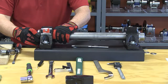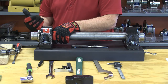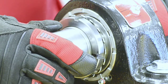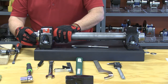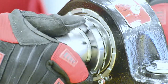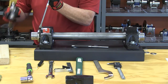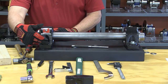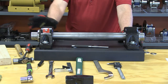Once we have our full revolution, the next thing we have to do is bend over one of the tangs on the lock washer — this locks the nut in place. If we don't lock one of those in place the nut will come loose. It's very critical when locking this over: you have to rotate to find which tang is closest. If one isn't right over one of the slots then you have to tighten the nut to get one into position to bend over. Never loosen it or you'll have to start all over. I bend over the tab and this bearing is locked in position. I haven't locked the mounting bolts yet because I still have a second bearing.